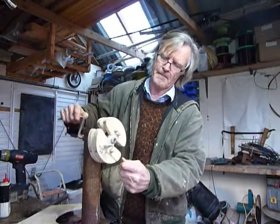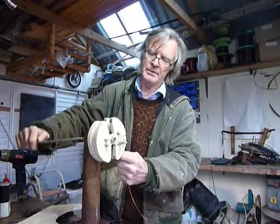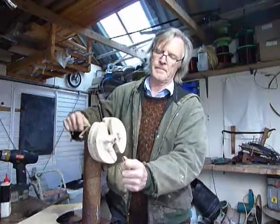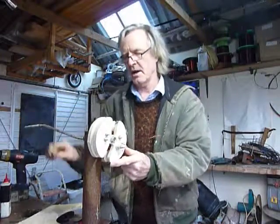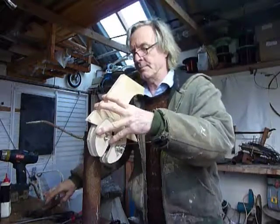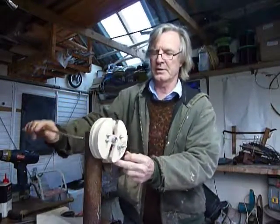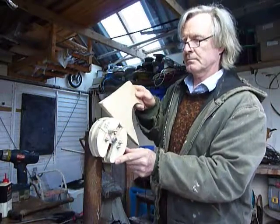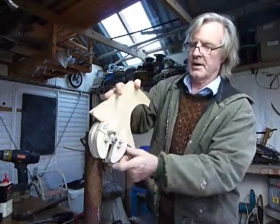Continuing to count through the turns — nine, ten, eleven... thirty-seven, thirty-eight, thirty-nine. When I get to forty, that's about halfway, and what I want to do is just pack them down a little bit. I'm going to give them a little tap with a hammer to straighten out the legs a bit so that they fit better in the stator. That's my halfway tap.